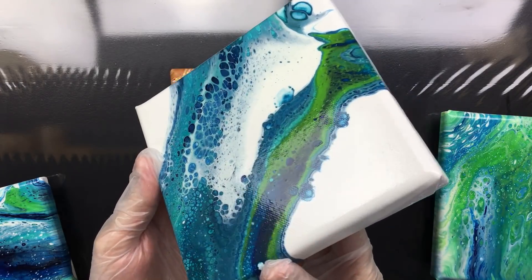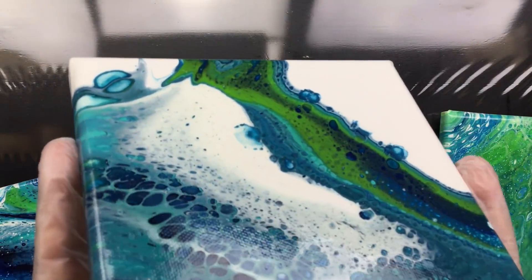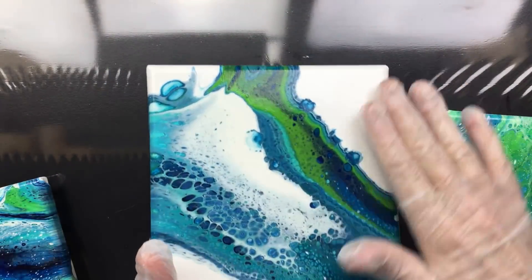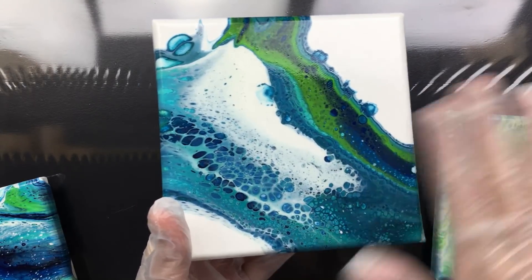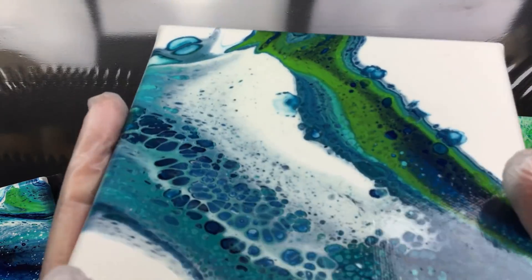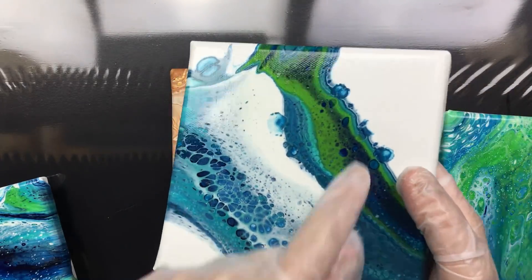Can you see how smooth that is? There is not one single brush stroke on there. Let me get it up a little closer. Now, when you start varnishing, you never varnish in one go — you always put layer, layer, layer. But as you can see, you have these little pin holes all over the place, and they do show in the first couple of layers. But I just keep on varnishing until they are all gone.